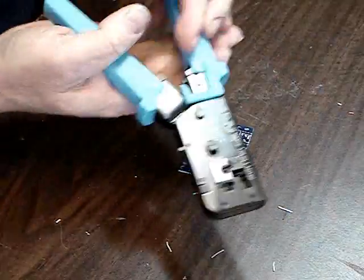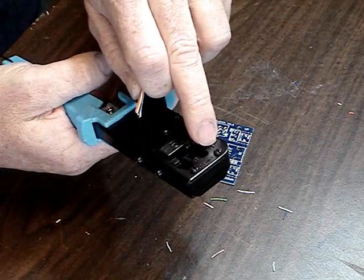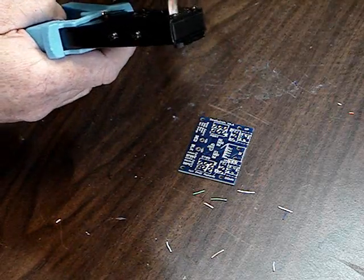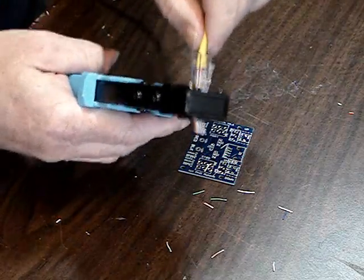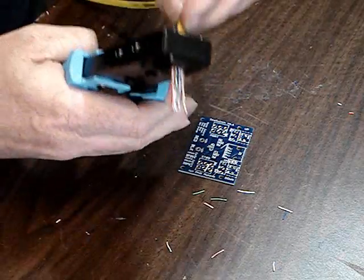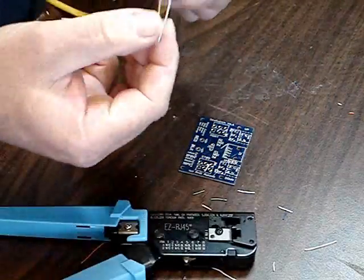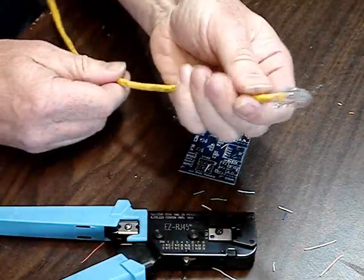For the final assembly, take your crimping tool, flip it over and find the side that has the 8-pin connector. You'll see it has a little divot in it and that divot lines up with the clip. Push the wires through the hole and fully push that plug in there — it should fit all the way down the side and the wires should be coming out the back. When you're all set, squeeze it, let it go, pop the plug out. There may be a couple of hangers on at the end, and you're ready to go. Give the cable a tug and there you have it.